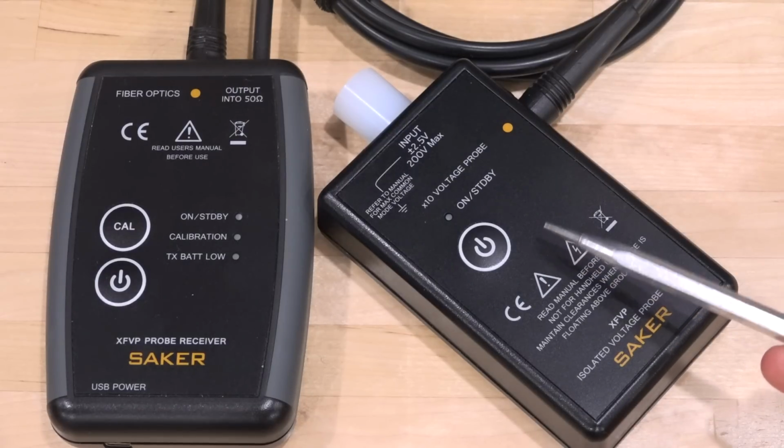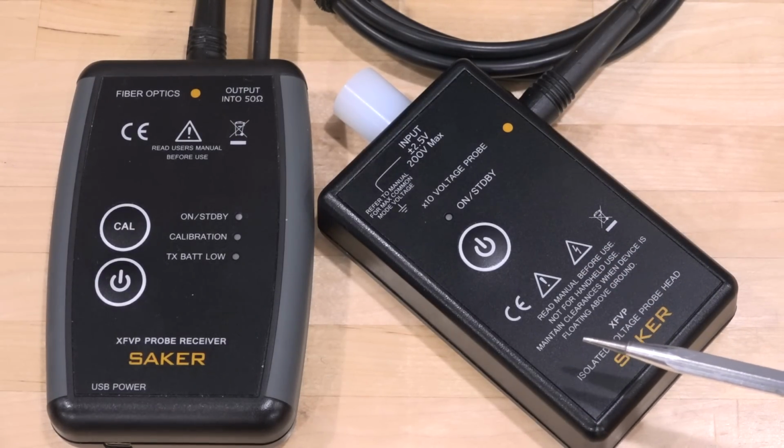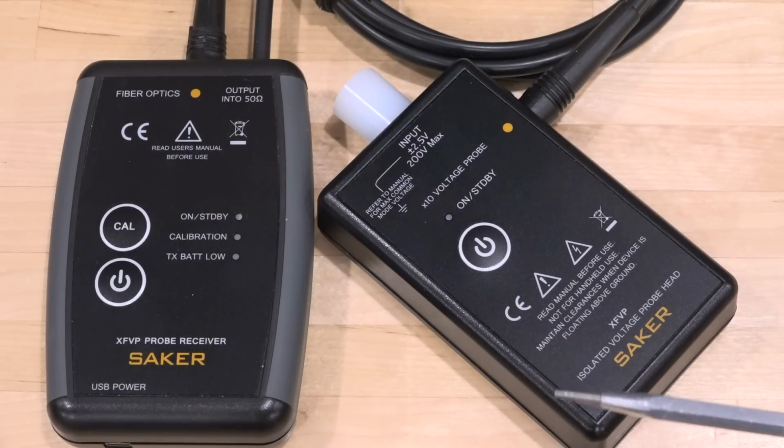And this gives a lot of confidence on the measurement that's being made. Now, this thing does support up to 250 megahertz of bandwidth, which is fantastic. So pretty good rise and fall times, which is required for the new generations of gallium nitride DC-DC converters that do have a very high frequency and sharp edges. So you should be able to characterize that with this reasonably well.